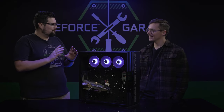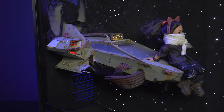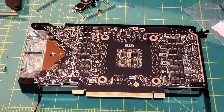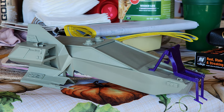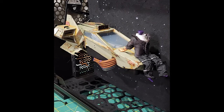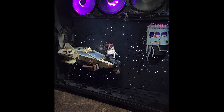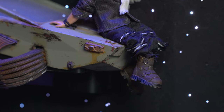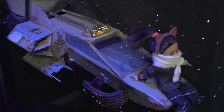It came out really well and adds some movement to the case. Speaking of movement, you have a little figurine kicking her legs perpetually. How did you go about doing that? It all started with the actual spaceship she's sitting on. I went with a Founders Edition 3080 Ti because the board on those is small on a small water block, so I could sneak that into the spaceship. I left just enough space on the top to run two little piano wires in Teflon tubes to the back of her knees where there are joints. Those wires run to a servo programmed with a microcontroller to oscillate and give her legs a nice slow kicking motion, kind of like old school animatronics. The spaceship looks great — how did you go about making it?